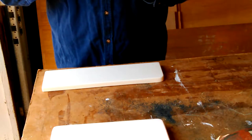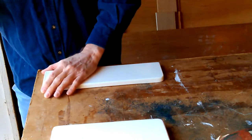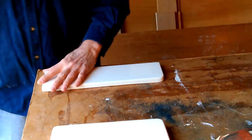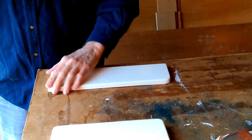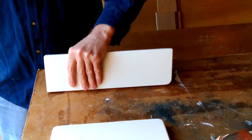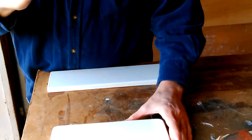I have to re-hit autofocus every time I start. Here's the close-up of my side splash after it dried. I had it outside for a week or maybe two, then I thought the weather's cooling off and I better bring it in. That's the original finish right there where you can see it — where I sprayed it came out really nice and smooth. One accident: I forgot to readjust my spray gun after cleaning it, so it was shut down but letting out such a fine mist it ended up being real smooth.